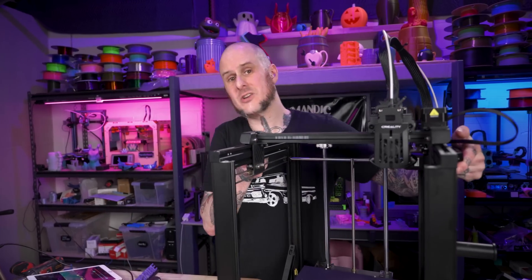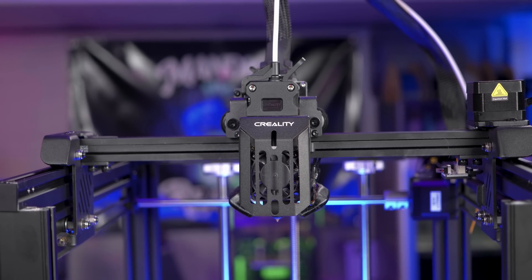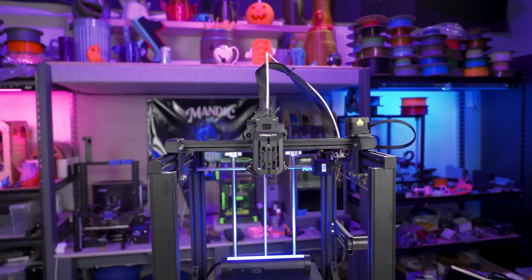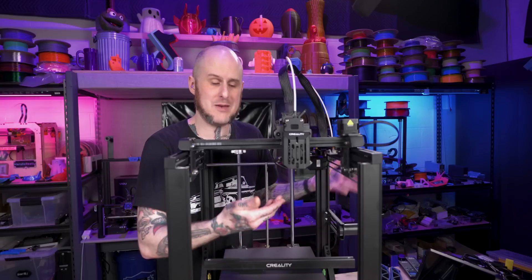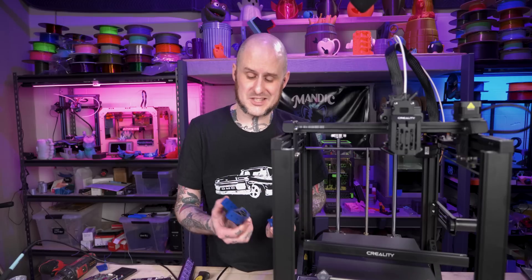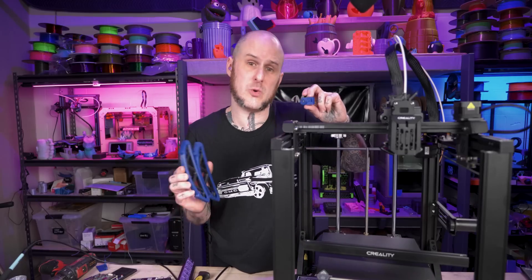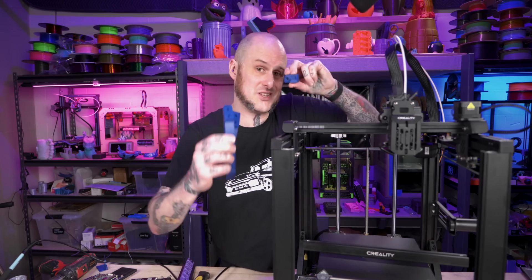We'll come back to this. With that all out of the way, let's get this thing hooked up to the Sonic Pad and running on Klipper already. You might notice something about this Ender 5 S1 — the front bar is missing entirely off of this machine. I removed it during the live unboxing because I want to actually be able to see my first layer and record while this thing is printing. However, since we're about to push the speed on this thing, I want to reinforce those front extrusions a little bit. So I've got some parts that I designed for my Mercury 1 build of my Ender 5 Plus that you'll be seeing real soon.